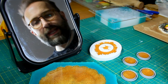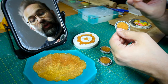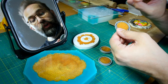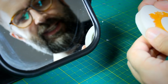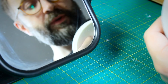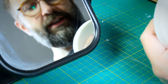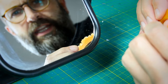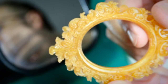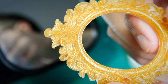Demoulding time. It hasn't quite been 24 hours but it has been 22. In reverse order of what worked: these old camera film lids - if you pour resin into a flexible plastic thing, it will not pop out. That's why you use silicone and not plastic. Next up, the overspill frame - still got a bit of bend to it. The instructions say 24 hours to harden, 72 hours to cure, and scratch and heat resistant after 21 days. This is my first ever. It's a bit bendy - about as bendy as one of those big oatmeal and raisin cookies. The mica powder hasn't quite made it gold - it's more of a glowing, slightly translucent, yellowy caramelly colour. But first attempt, very nice.